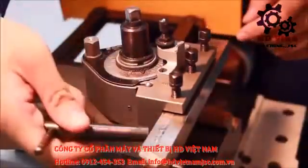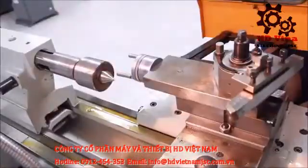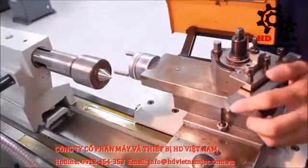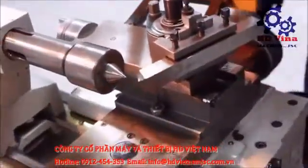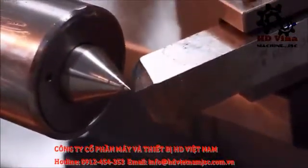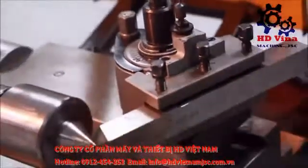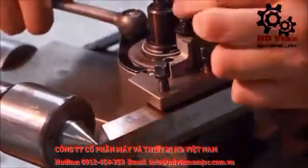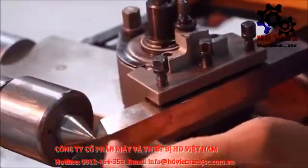The tool is now fixed and I can turn my workpiece. The first and most important part of using the lathe machine is aligning this tool according to the revolving center. Basically, you have to touch both pointy edges together. The tool is aligned — as you can notice, both the sharp tips are touching each other.